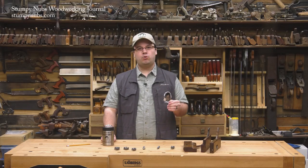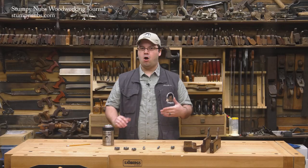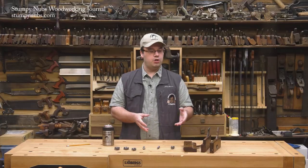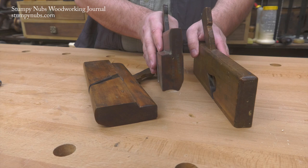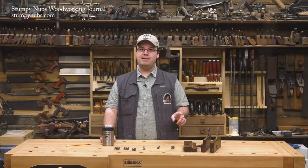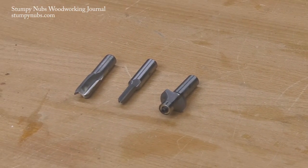This is because molding profiles are little more than a collection of coves, beads, and flats or fillets. All those fancy moldings you see on period furniture were originally cut one cove, bead, or fillet at a time using what were called cove or hollow round and rabbet planes. If you had enough of these planes, you could make any molding you could draw. But today's woodworkers don't have these planes — instead, they use the modern-day equivalent router bits that cut similar basic shapes.